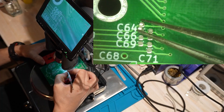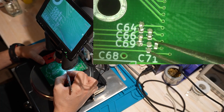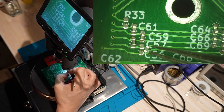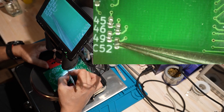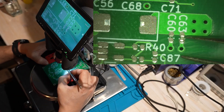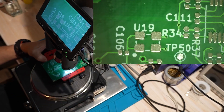This helps the parts stay in place and prevents them from flying off the board when we start reflowing with the air station. I'm also cleaning my tweezers with isopropyl alcohol whenever they get paste on them, because these parts weigh nothing and if your tweezers are sticky, you'll fight every placement. Resistors are the worst because they're so light, so just relax and don't rush.